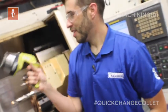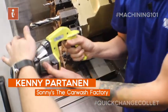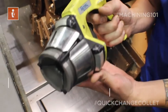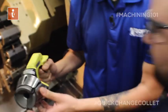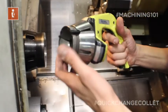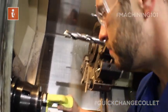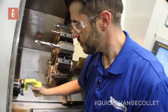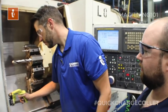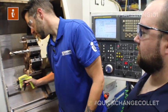So now what is important — you'll notice there are notches, three of them on this collet. There is on this chuck a little pin. You're going to want to line up one of those slots on that pin as you push that collet in. So while you're pushing forward, you're going to pull that other release trigger. There you go. Your collet's in.